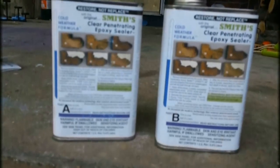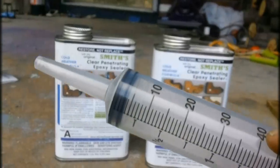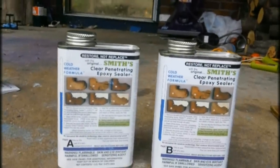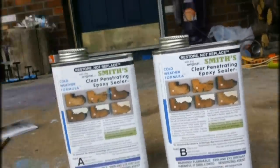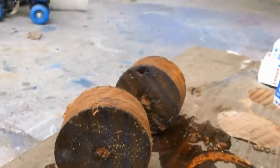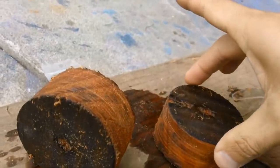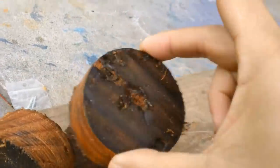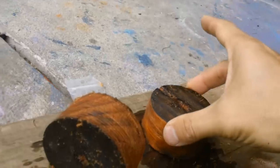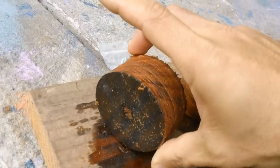I'm going to inject some penetrating CPES epoxy to help harden up the holes in the wood. I'll mix equal parts of CPES penetrating epoxy with a plastic syringe and then soak the wood with it. Here's a look at the three-inch wood pucks going into the three-inch bored holes — I drilled them with a three-inch hole saw and soaked them in CPES penetrating epoxy. I stuffed the holes with wood shavings and epoxy, though it's irrelevant because I'll be drilling new holes for new fittings through the center of these anyway.